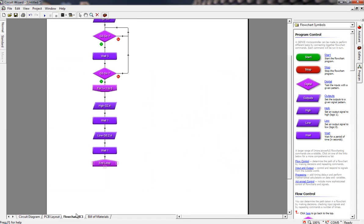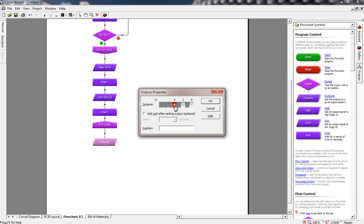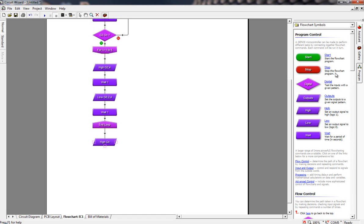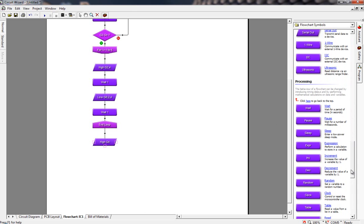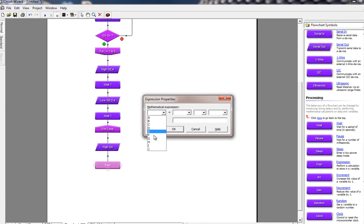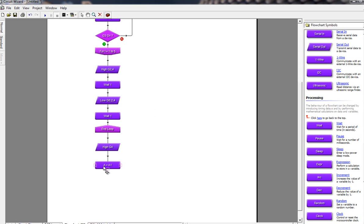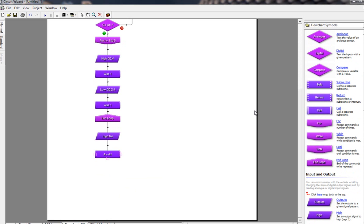Back to the flowchart: once we've flashed five times, we're going to finish by turning on the red LED — output four — which stays on in a nice steady state. We also need to read the value of the analog input. Scrolling down to the 'expr' shape — short for expression — I'll place that, double-click it, and say that variable A is equal to whatever I'm currently reading from my analog input sensor A1. A is a bit of memory in the chip that's going to store the current light level.